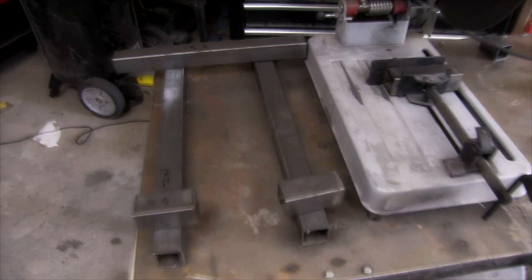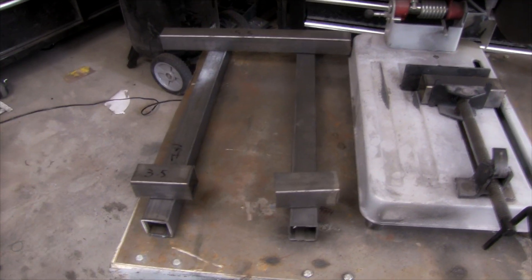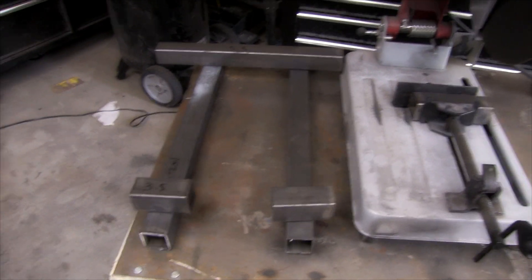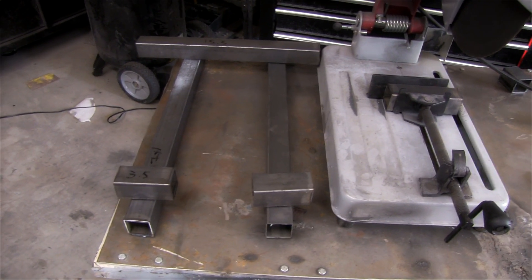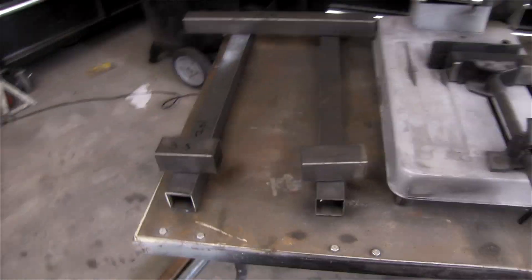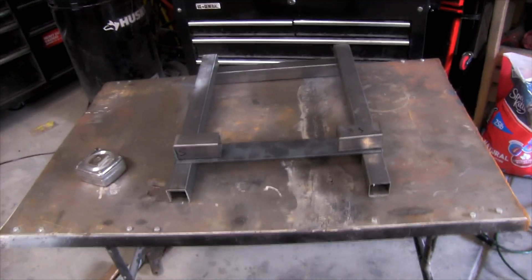There are going to be two tabs coming up on each side with a hole in them for the bar that goes underneath to secure the bike, using the two eyelets that I bent when jacking it up, as I showed previously. I'm going to tack weld this together and see if I've got my dimensions right, then cut a piece of flat metal to act as a brace to keep everything at the right distance and make it sturdy.